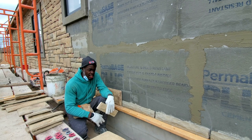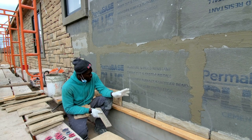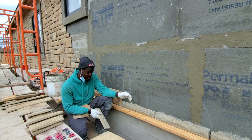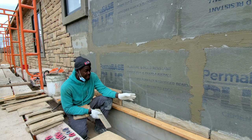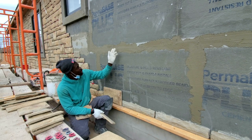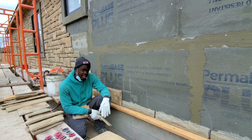The way I'm going to teach you — whether you're laying veneer stone on a concrete wall, brick wall, or cement board — is the same process. Today we're laying it on cement board. You want to put Tyvek over your wall first, then tape up the seams. After that, go over your cement board and waterproof the entire joints. Put your mesh and waterproof it, then put some mud over your screws before you install your stone.